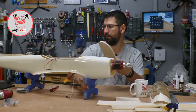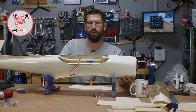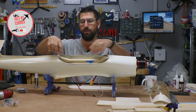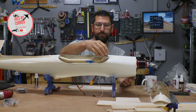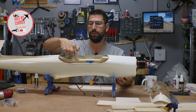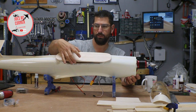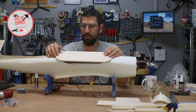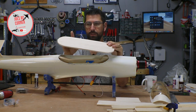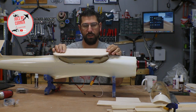On the opening here there are two angles. On the original plastic piece that was in here, the plastic came out and then followed this contour, then followed this contour up to the top. We're going to mimic that on this piece of balsa wood. The first thing I need to do is get the measurements from here to the start of this upward slope, and then I'm going to cut this panel into that shape so I can get the center section done.